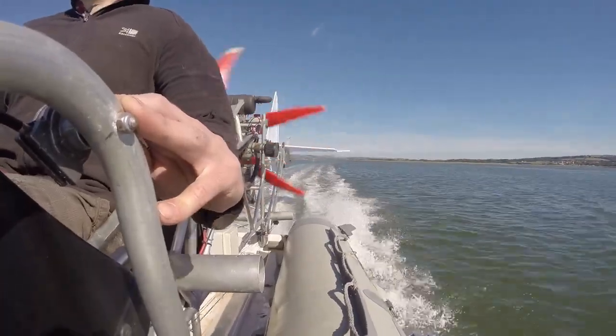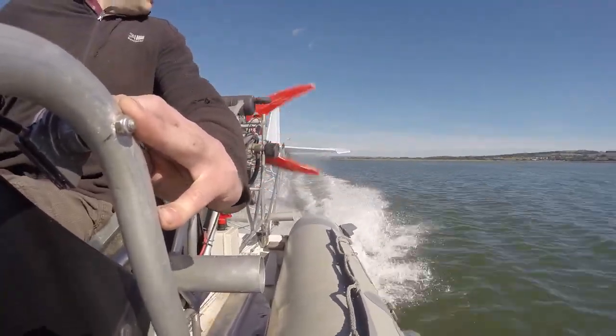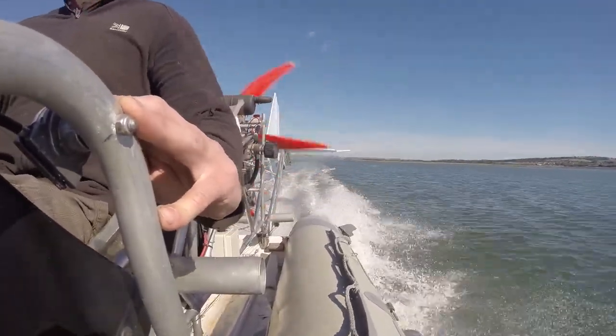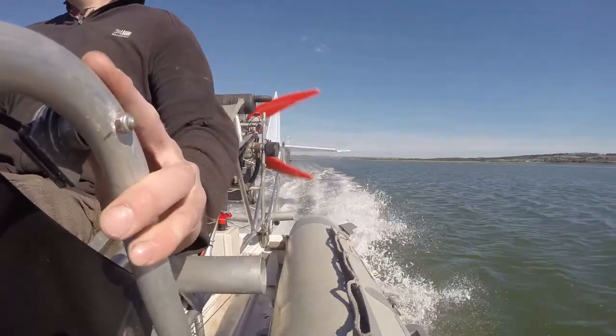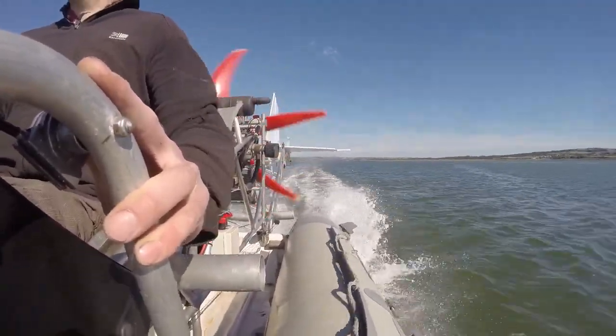With the elevator, notice I have aerodynamic horns. This was just to increase the size of the elevator, but there was quite a noticeable difference in stick forces when compared to the rudder, which does not have an aerodynamic horn. The horns reduce the force needed to deflect the control surface as it operates on the other side of the hinge. I wish now I had added a horn to the rudder.